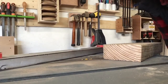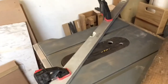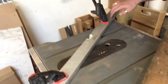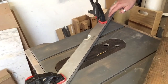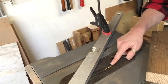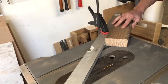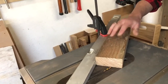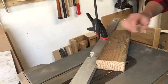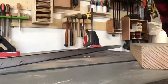Let's get to it. If I lift you up a little bit — apologies for the camera. You can see what I've done: I've taken the fence off the saw and clamped this spirit level as a guide. I've just got the teeth of the saw blade showing. The intention is to slide this along nice and slow and easy and cut through that way.